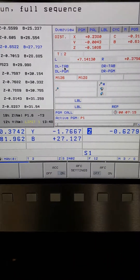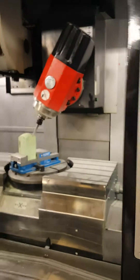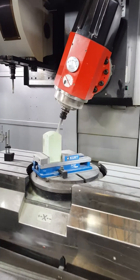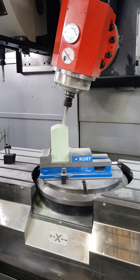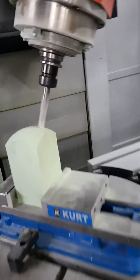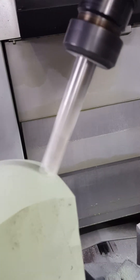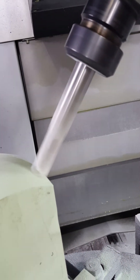All the registers are moving there at the bottom of the screen, producing that sphere with a flat end mill across nearly 8 inches over that part. X, Y, Z, B and C are all moving together to keep the tip — the flat tip of that end mill — perpendicular to the machining surface.